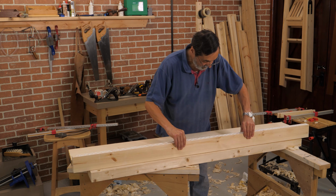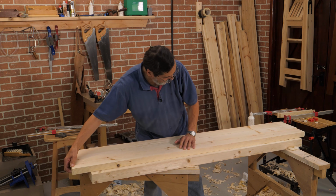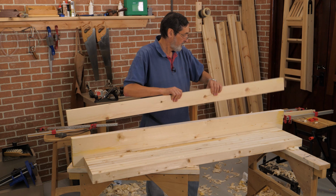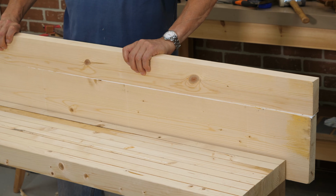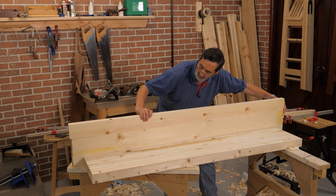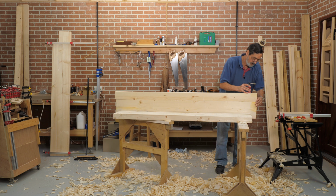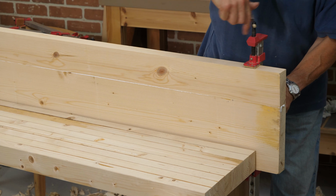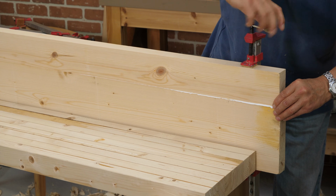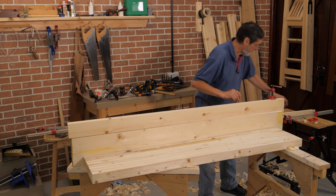And then, so I'm rub jointing, take it apart. We are good. Bring this up. Flush. We still haven't finished surface planing. We're going to be planing this again afterwards at a later stage, not just now. After this is glued up, everything's dried, we're going to go back in, surface plane to get the joint line down, everything flush and so on. A little bit of pressure, not too much, because that will cause it to slide if you put too much pressure on.